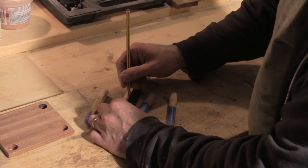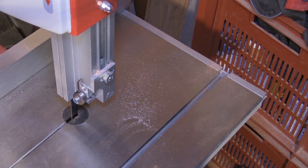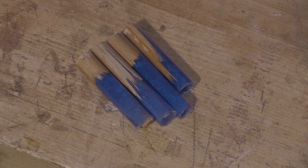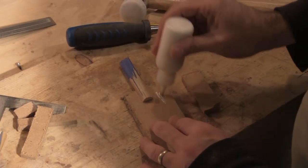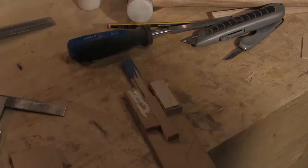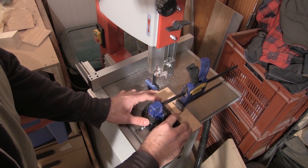First I'm going to cut off any excess wood from the bottom of each piece to ensure that the resin join is featured. I use the bandsaw to trim off the excess because it has a narrow kerf and will therefore help me avoid any tear out I might get using a tenon saw. With the pieces all trimmed I'm now ready to cut them all to a uniform length. To do this I'm making another simple jig to hold the piece while I cut it on the bandsaw — the jig is just cobbled together out of bits of scrap MDF and popsicle sticks. I secure my jig to the mitre gauge on the bandsaw and use it to cut all the pieces to equal length.